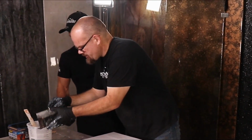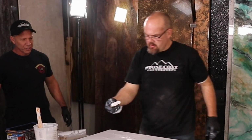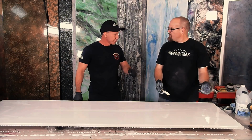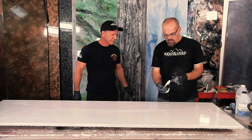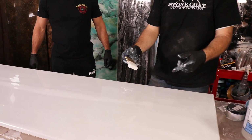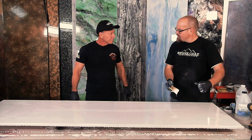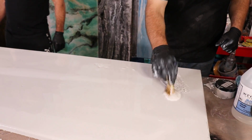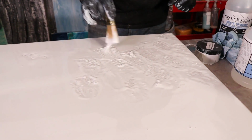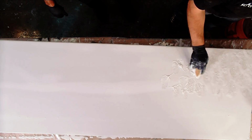And then I'll prime that brush. You prime that, you don't want to have a dry brush on it, that's for sure. Because what happens is you'll be low here. When I start chopping, you're pushing it away, it pulls it, soaks it in. And then I've previously pulled as many loose bristles as I can. And just search your piece for loose bristles after you do that. But typically, if you pull on it, you're good to go. Just like with my rollers, a lot of times I'll take tape backwards and peel them off. That's smart.